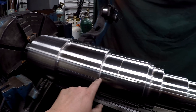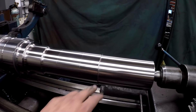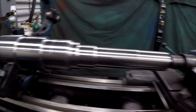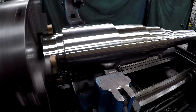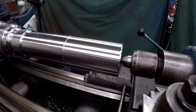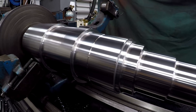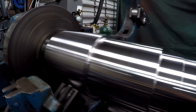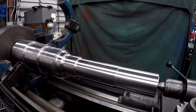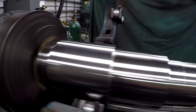These would be one-sixteenth radiuses there - sorry, one-eighth radiuses - that's a one-sixteenth radius, and quarter-inch radiuses there. I believe I used the one-eighth radius on that one. But it looks good - we'll just spin it up and you can see it running. I'm gonna get it out of here, splash some oil on it so it doesn't flash rust on us, and move on to the next job.